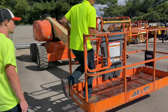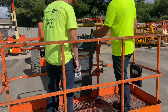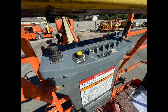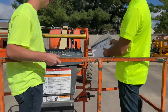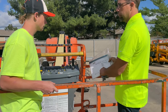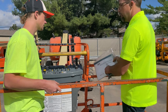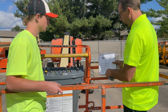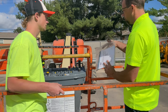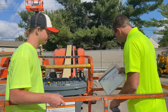When we put ourselves in the air, step up here and look at everything — does it look safe to operate? Are switches and controls all there? Nothing broke off or missing? And here's the last bit, very critical and important: inside the manual box should be a few things — the correct operator's manual for the machine, this is a 600S so matching the serial number breaks, preferably in English. You also need your ANSI book, and a current annual inspection form — legit, properly filled out, up-to-date — preferably in a plastic bag to prolong the life of it. The last thing you want is to open a soggy manual stuck together.